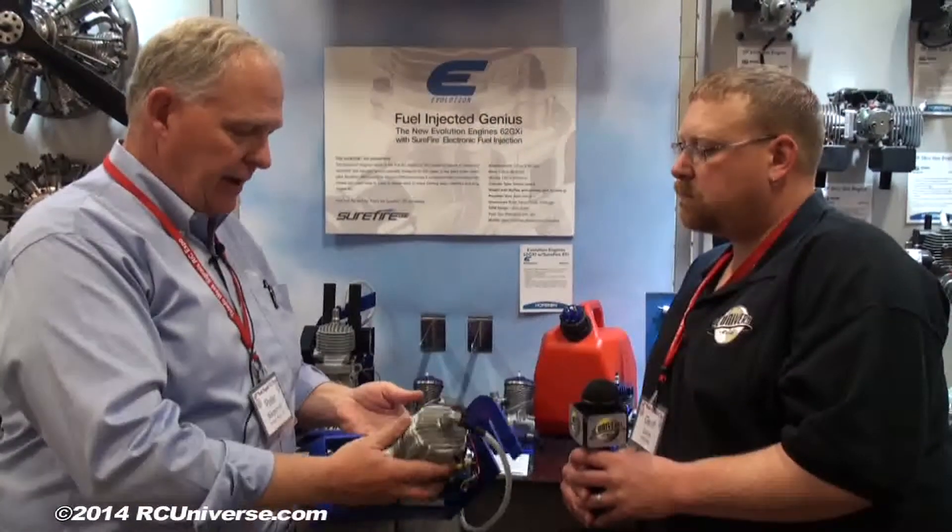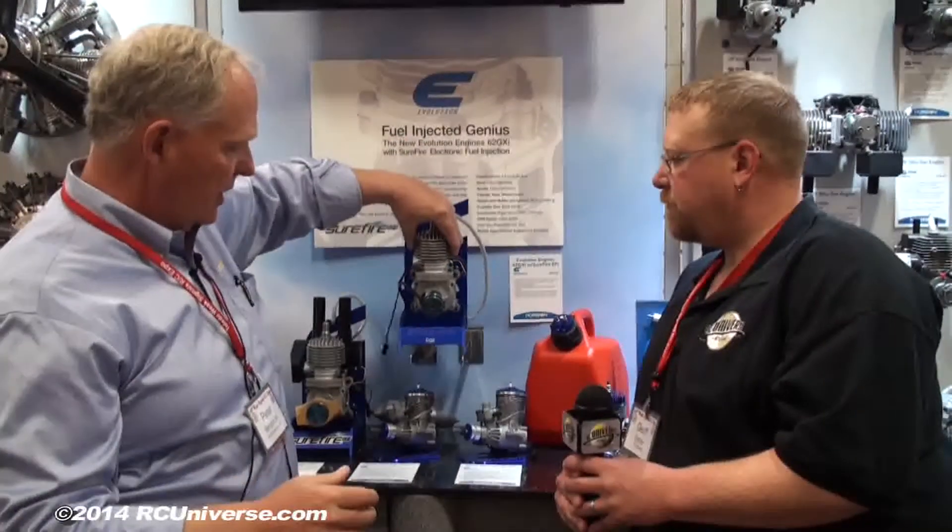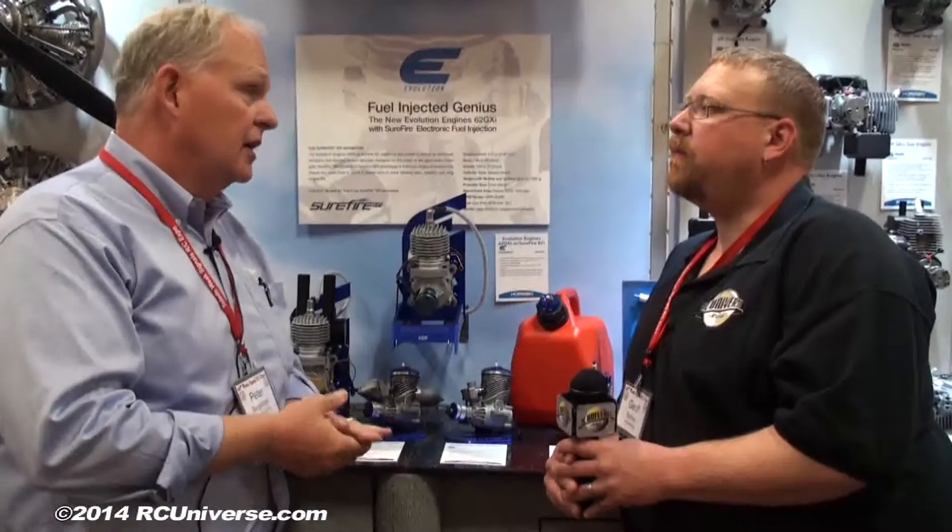We matched the bolt pattern to the DA60 for the mounting bolts, the propeller bolt matches the DA60, and the exhaust port matches the DA60, so a lot of common accessories already in the field will be usable on this engine right from the beginning. If the included muffler doesn't fit the application, users can put a canister on it — we tested it well with canisters. The system adapts to different propeller sizes and muffler systems straight out of the box. The price is $579, and we should be shipping the first ones in mid-May — about six weeks out.